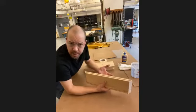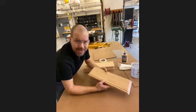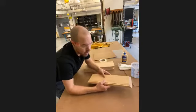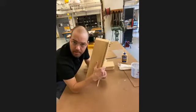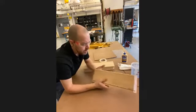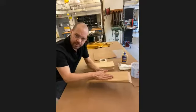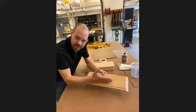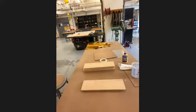There are different qualities of pine. Some pine trees are very young and crappy — they cut them down and sell that wood, which is considered raw pine. Then there's what's called select pine, and that's what you guys have. When you look at it, you'll notice it has a nice, firm grain with not a lot of weird scars or strange knots, whereas lower-quality pine has more imperfections.